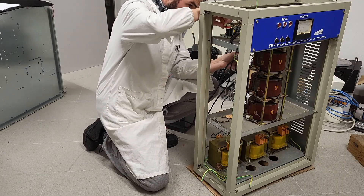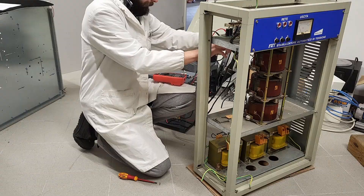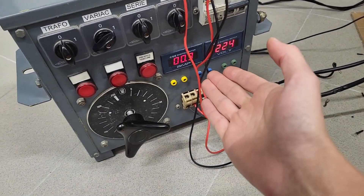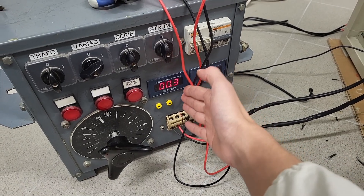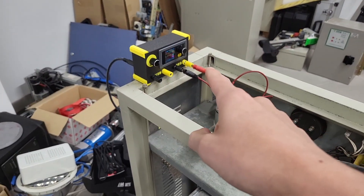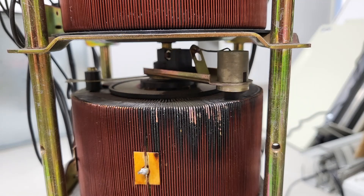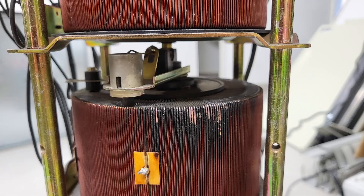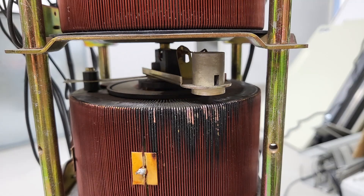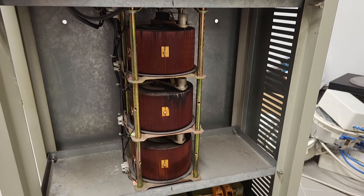With these measurements I can now complete the schematic with all the basic information for the power section. I connect the rest and check the other two branches. Surprisingly, the central variac — the one that seemed burnt — is working just like the others, with a current absorption of just 30 milliamps under no load. Under load with the motor running, except for a bit of stuttering where the burn damage is, everything flows perfectly with no sparks at all. This monster still seems to be working fine electrically.